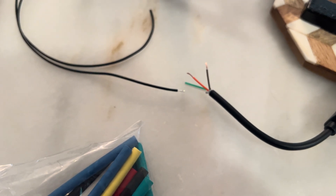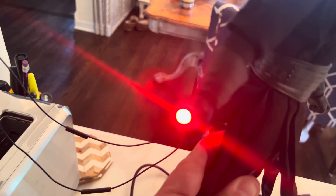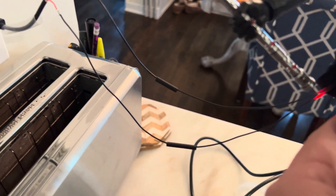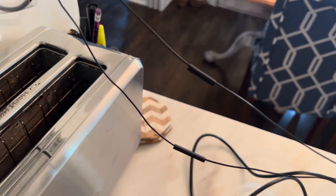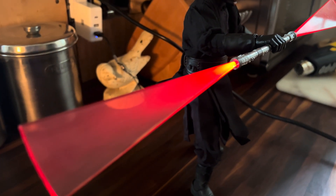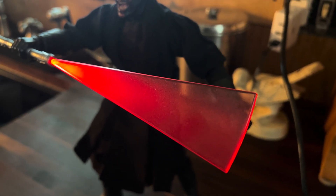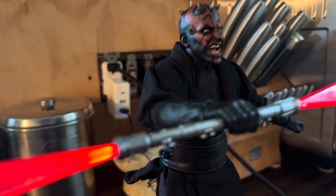The white and green are for data transfer since USB can handle different media and charging modes — we don't need those. We repeat the soldering process and this is where I'll use the heat shrink tubing, sliding it onto each wire. I soldered the wires together and then did a test — plugging it into a regular USB outlet power — and as you can see it lights up. Testing throughout the process means if there's any issue I can stop and correct it on the spot. I want to credit Denobi 2 in the video — he's doing a lot of USB wiring work. You can see there are two wires hanging out the back; you could twine those together into one single wire and heat shrink the whole thing.